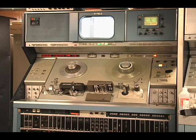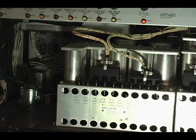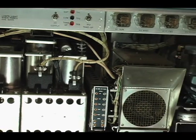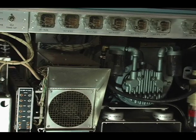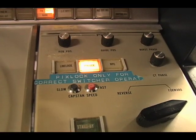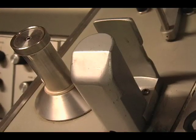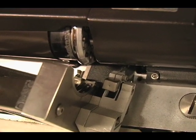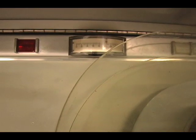I tried something new on this one. I have a 20-amp Variac, and I thought that if I brought up the line voltage slowly to the linear supplies, I might save some electrolytic capacitors. Over a period of a couple of days, I disconnected all the fans, motors, and blowers — because they don't like low voltage — and fed the linear supplies with the Variac. I ran it up in increments of about 10 volts for two or three hours each step, until I got up to 40 volts, and then relays started clicking, the audio amplifier started oscillating, and I smelled smoke. So I cut that out Sunday afternoon and decided next time I'd put full power line voltage on it and find out where that smoke came from, since I wasn't able to find it at 40 volts.